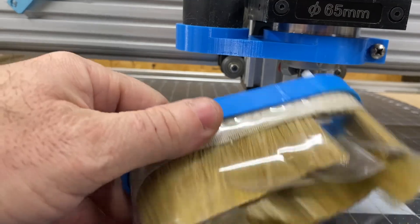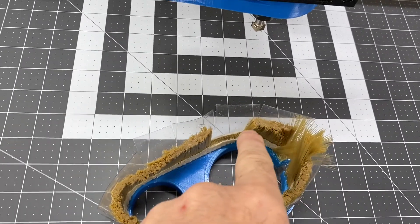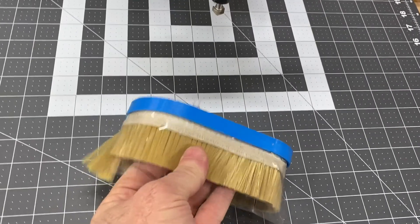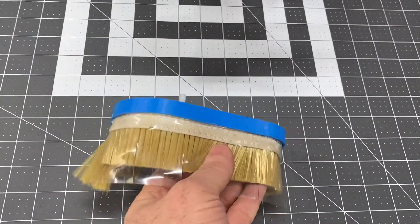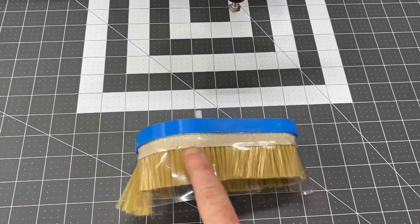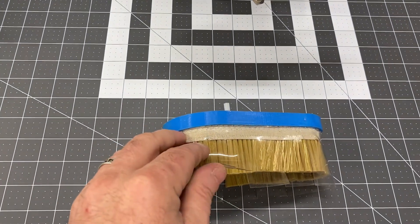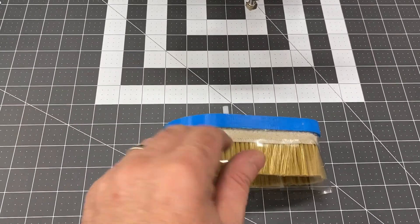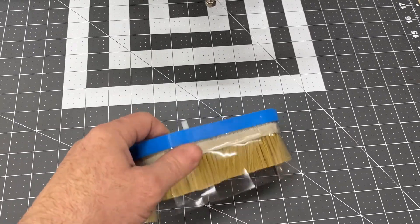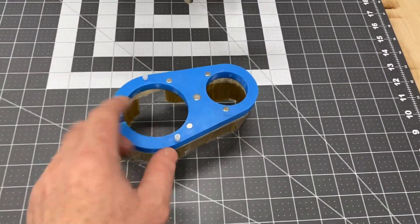I have a strong magnet in the very center and four semi-strong neodymium magnets around it — that's all you really need to hold it in place and center it. The bottom side of version one is trenched: inside the entire perimeter is a quarter-inch wide trench that's three-eighths deep, allowing you to fit a bristle kit you can buy on Amazon. Along the outer side I also fitted vinyl sheet, glued into the trench, which you can buy at any hobby or quilting supply store such as Michael's or Joann's.